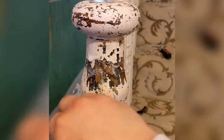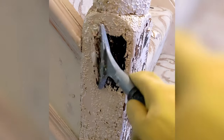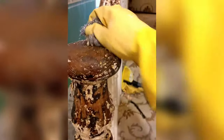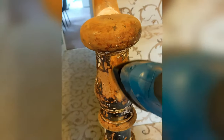It took a while, but it all scraped off pretty well, revealing the original dark wood underneath. The stripper also recommends using wire wool to help flake off any remaining paint. For stubborn bits, I then used the detail sander, taking it completely back to the wood. This works an absolute treat on the handrail — so lovely to see this original feature back to its full beauty.